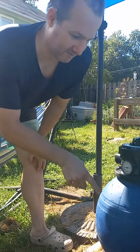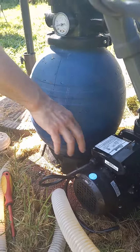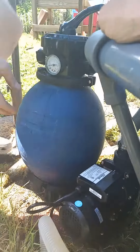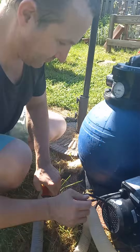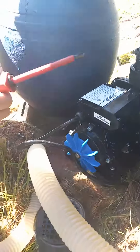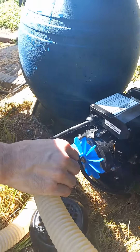I have a pool pump here with a filter. My motor was humming but nothing was pumping out. I changed the sand but still nothing happened. So I took this cover off — it's unplugged of course — and I could see this was humming but not turning.